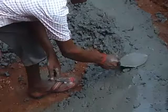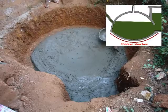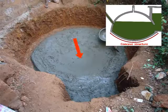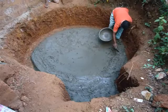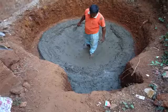The gravel cement mixture is now ready to be used. Use a small trowel to lay this mixture at the base of the pit in a circular manner. The thickness of the plaster should be 3 inches from the ground. This will form the floor of the pit. Recall that the floor of the pit is concave in shape, so the foundation will also be concave in shape.